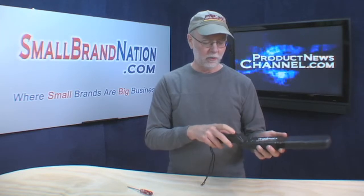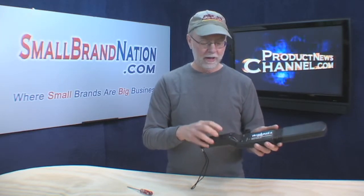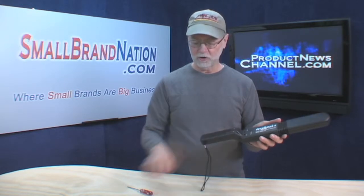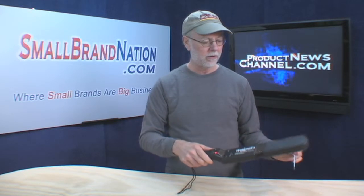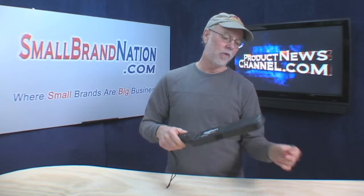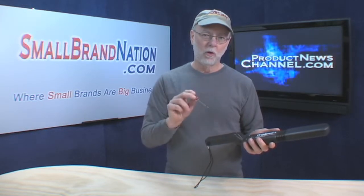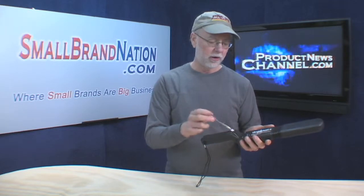Let's get right into the tuning now. So we turn the unit on, and under normal conditions, the unit will beep, the red light will flash one time, and then this little green light about every 5 seconds will flash, and that means that it's able to detect. So we take our little screwdriver here, hold it under, and you can see that it's detecting that screwdriver at about 4 inches. To tune it, we leave the unit on. The objective is to be right on the threshold of where it starts to beep and stops to beep when you're turning this little screw.